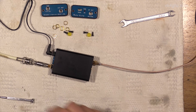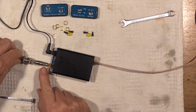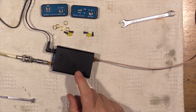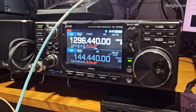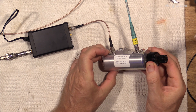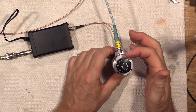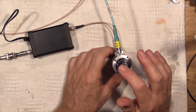The output of the four-way splitter system is plus 12 dBm. So I've got an 18dB SMA attenuator here. The specifications for the GPS9700 — it's looking for an input from 0 dBm down to minus 20. I've got the Minikits GPS9700 hooked up to the IC9700 via one of these — this is a stepped attenuator, actually rated up to 2.7 gigahertz, quite a handy piece of kit. So I can switch in attenuation from 0 to 60dB in 1dB steps.